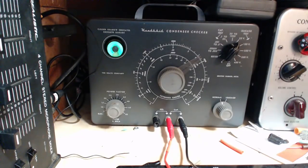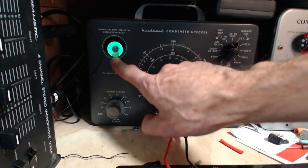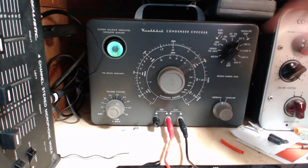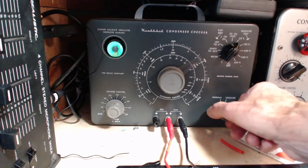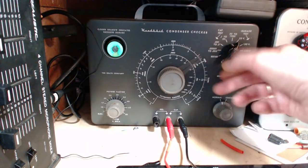So it's very hard, as I've said before, to get this stuff on video camera, but you want to watch the gap in this eye here. Okay. Get it on 25 volts. I'm going to apply 25 volts DC across the capacitor. That'll cause the eye to close and hopefully, well, not hopefully, we'll see if it opens again. So that went really fast.